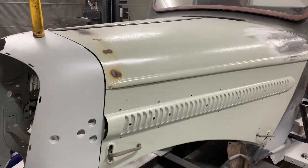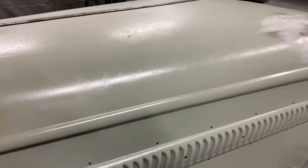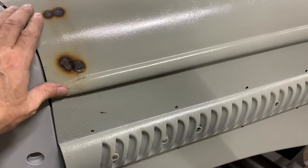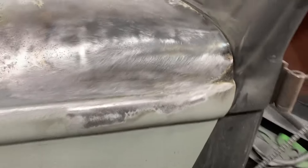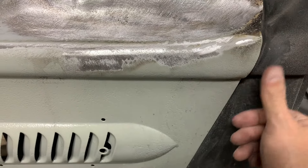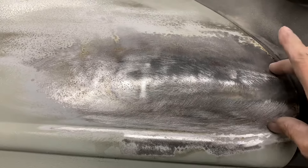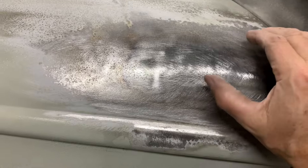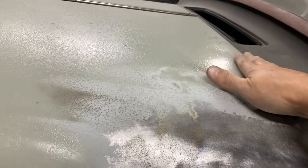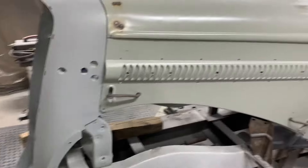Here's what I got so far on the hood. I put that support in and I'm probably going to put more supports in. The thing of it is I had to get the hood to fit right here and fit right in the back. The support in here helped me fit that well. Back here I noticed - I showed that my finger would go right through there - now it's flush. It might be just a little high here but I can do a little work to make that match. What I did is I took this area and heated it up and bent that curve back the way it is, and that's how it got in there. Now it fits along here just like the other side - it's all workable now.